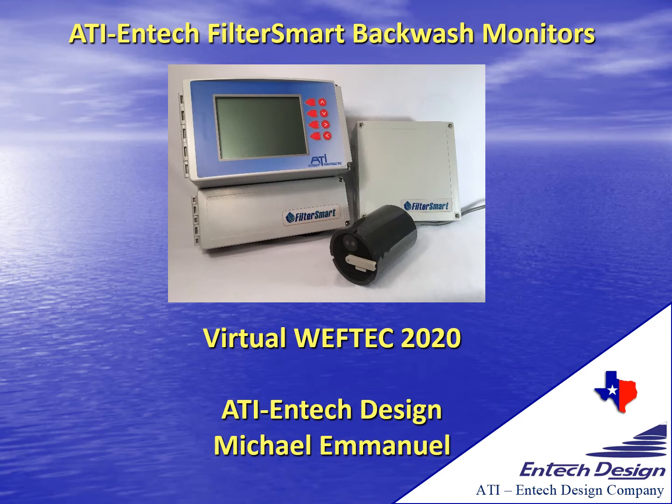Until now, operators have had to rely on two surrogate measures during backwash to ensure proper cleaning of gravity filters. The first is flow rate, which is an indirect measure of the expansion of the media. The second is time. However, wash duration based on time typically incorporates a factor of safety to ensure the filter is sufficiently clean. But this leads to wasted water and reduced media life.